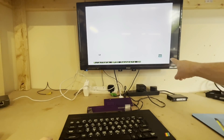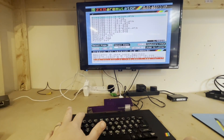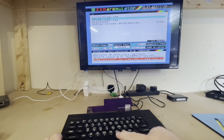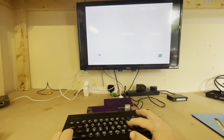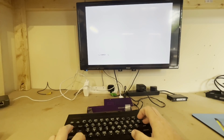Symbol Shift, Cap Shift, Enter turns on this virtual keyboard mode, and with that we can access the function keys by pressing 1, 2, 3, etc. Pressing 1 brings up the file list and we can then page down to Manic Miner — this will be a good test of both the keyboard and the sound. I press Space to load the tape in, come out of that menu, then Cap Shift, Symbol Shift, Enter again to come out of virtual keyboard mode, and now we can issue the load command.